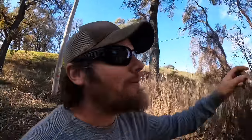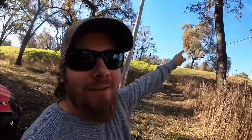We're back down here on the other end again, and I don't know if you can see on camera, but this wire is like 10 feet off the ground because the last place that it's attached is on top of the levee. So as I tightened it up, it just picked it right up. So this is going to be a good use of the insulated line post because the wire won't be able to pull those out of the ground, and it'll keep this down where it needs to be.